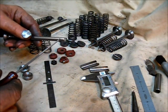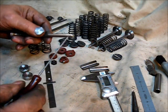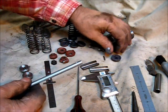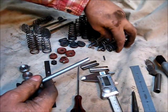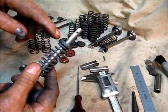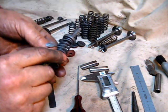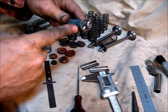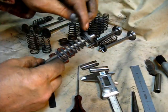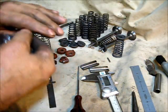I've just finished drilling the cross pin hole and cleaned it up with a round file — one eighth of an inch. The spring goes on here, the cast iron keeper goes on the pin, and the cross pin goes in there like that — that's what holds it in. Your rocker arm works on this part right here, and that's the assembly of that.